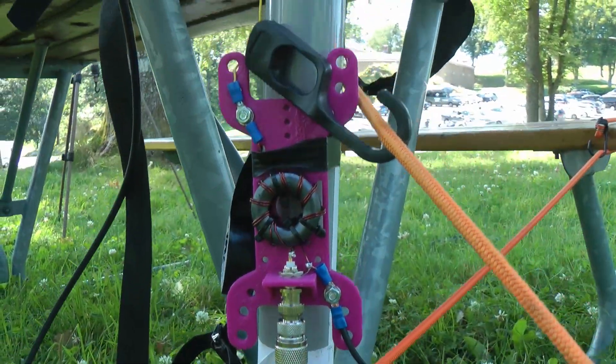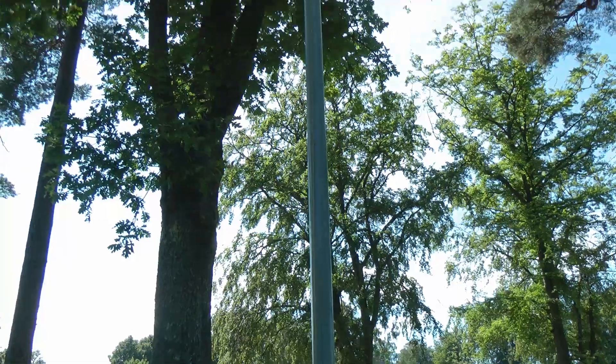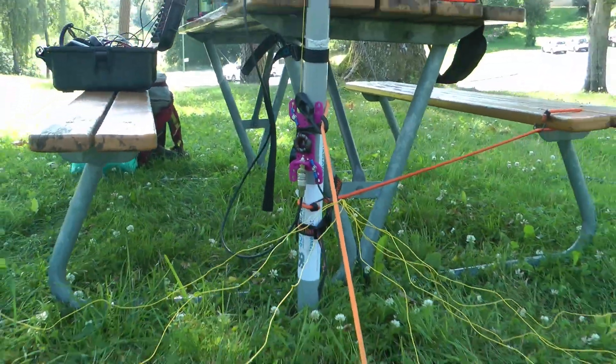A Rybakov is basically a 4-to-1 balun. It's 7.6 meters of radiating wire going vertically, and vertically is the important point here. It does not perform really well as a sloper or as a flat top, but it performs excellently going vertically. I guess there is some magic to it nonetheless. And then underneath that, you'll have a radial net. Pretty simple, isn't it?